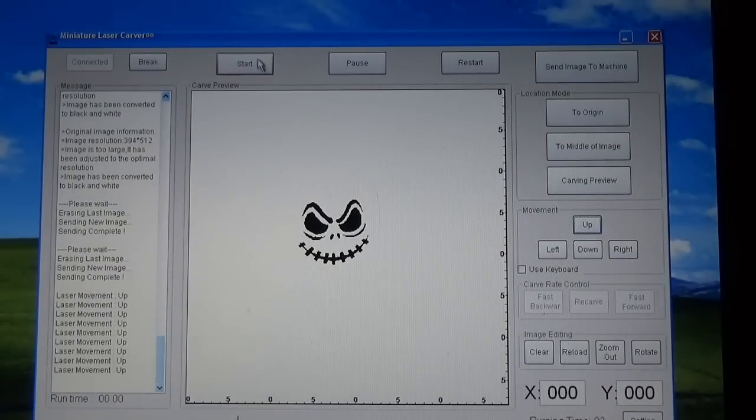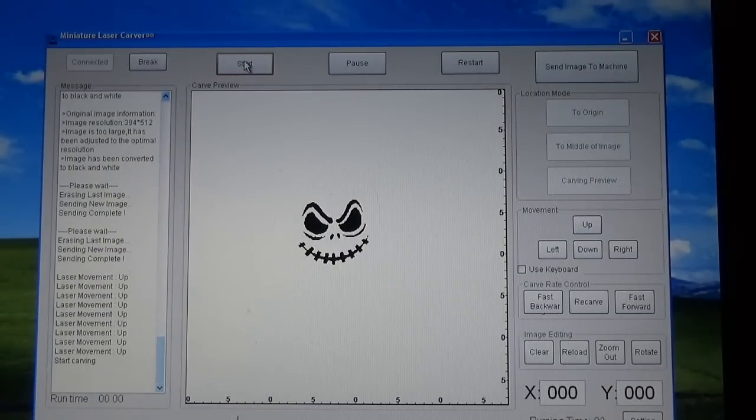Cutting is probably the wrong word here, more like burning off the paper in the masking tape. You're watching the laser work through the camera right now, but I hope I don't need to tell you that you should never watch this laser with your bare eyes. The laser is so bright the camera is having issues recording it, and I'm only running it at 1/4 power. To actually see what is going on, I can place a filter over the lens of the camera to help dial back some of the brightness.